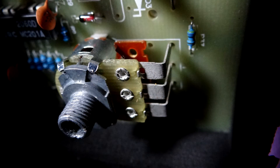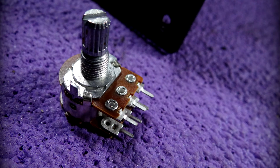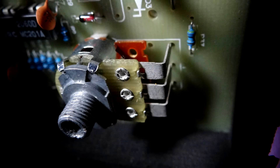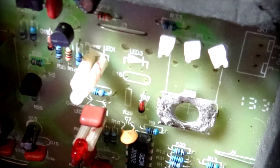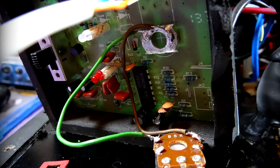With the circuit board out you can see the volume pot sitting on the PCB. I started with the aim of leaving the chassis of the old volume pot in place to give me something to solder to — creating an earth connection at the bottom of the pot. Because it's a dual-ganged pot there are two sets of three lugs coming off the potentiometer. I left the old right-angled connectors already soldered into the PCB, then soldered wires from those lugs to the new potentiometer. I tinned all the areas first, then heated the wires and put them in place, making sure I had no dry joints.